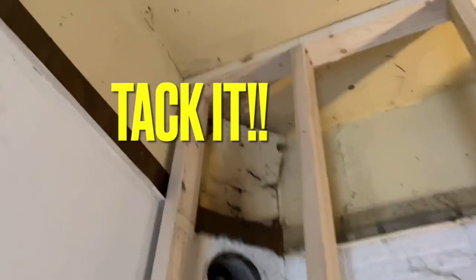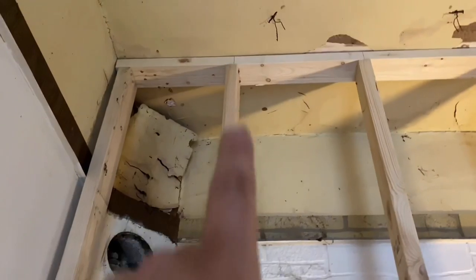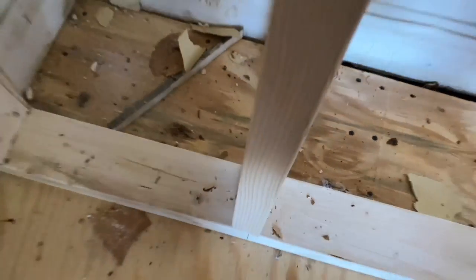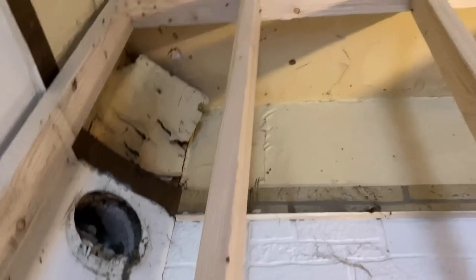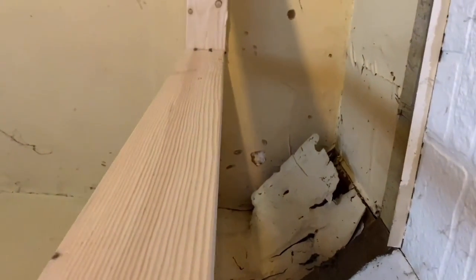Another thing I forgot to mention is, on the left and on the right, you're gonna wanna put a few tack nails once you get your wall level the opposite way as well. So you want your boards flush with that top plate and flush with the bottom plate, real smooth like this, where you can sheetrock it easy. And then once you got that, that means these boards are straight, but now we need to make them straight also this way. So you can see at the top, there's a bigger gap than at the bottom, just barely, not recognizable by the human eye.